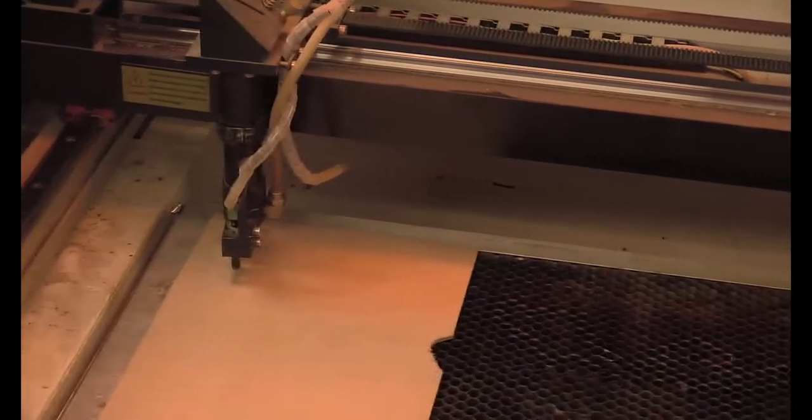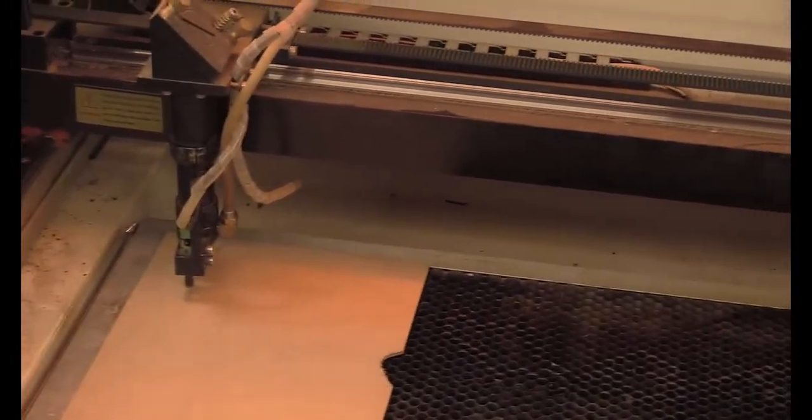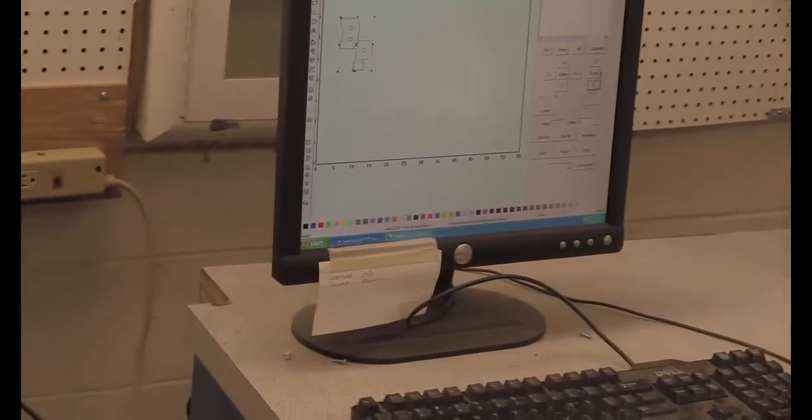Okay, put that underneath here. Gently slide it up to underneath here. The honeycomb mesh sometimes makes it hard to get it in place. What I'm going to do is get ahead of the game and Z-datum this one off. So I'll Z-minus, and then I'll Z-datum again. And there you can see it's re-registering the part.